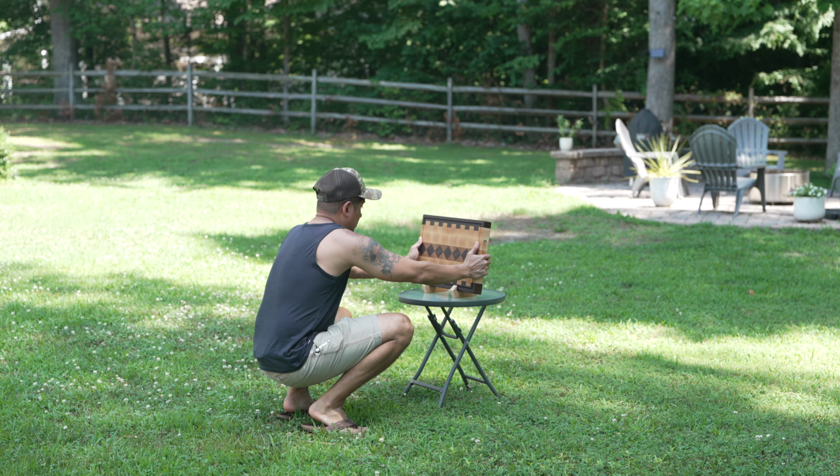On the bandsaw, I cut the cherry into 3 manageable sizes. I was being lazy and kept a 1/2-inch blade instead of switching to a 3/8 blade. The tight curves took a lot of time and put too much pressure on my 1/2-inch blade, and it broke after the 4th stand. I ended up using my 3/8 blade anyways.